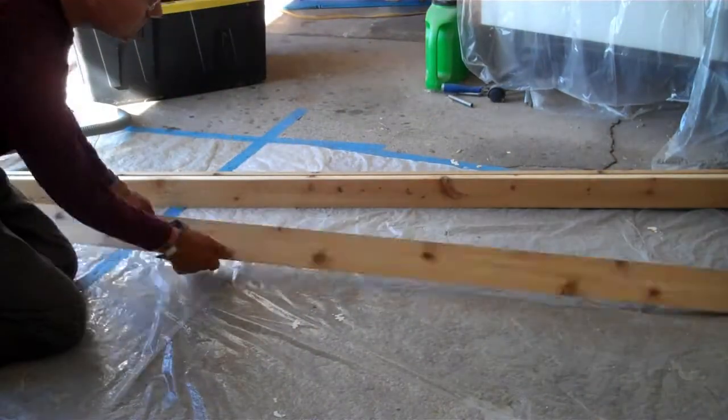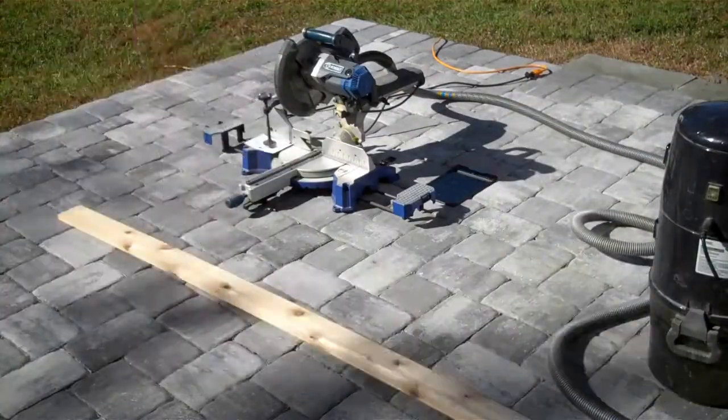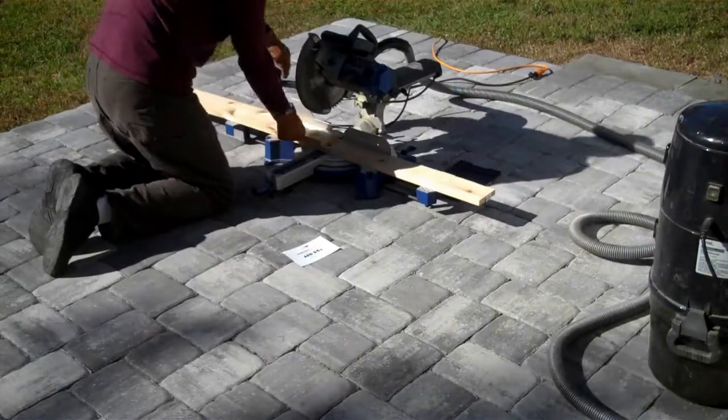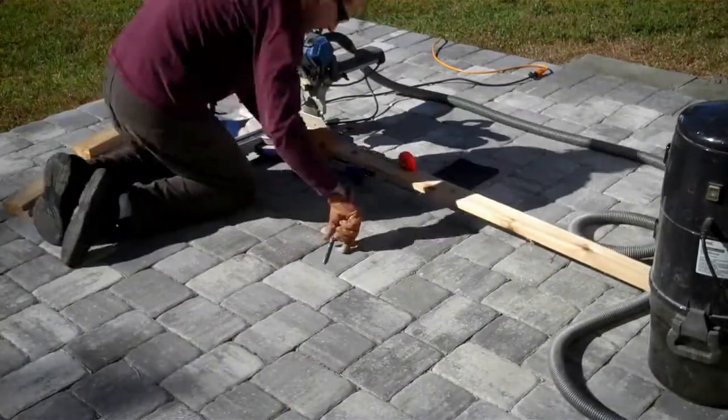I let these cedar boards dry for a few months in my garage. I'm using the straightest ones for the long cross pieces, and the more warped ones will serve as smaller uprights. They will give strength and provide a place to screw in hardware later on. I'm using cedar because it is strong, light, and water resistant.